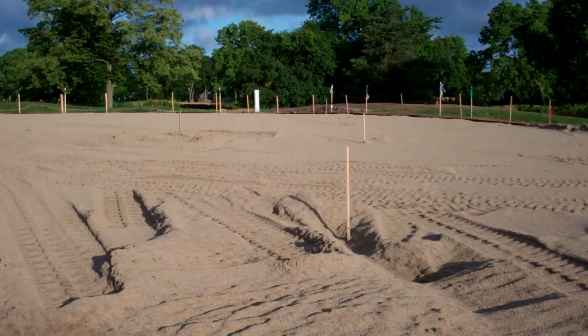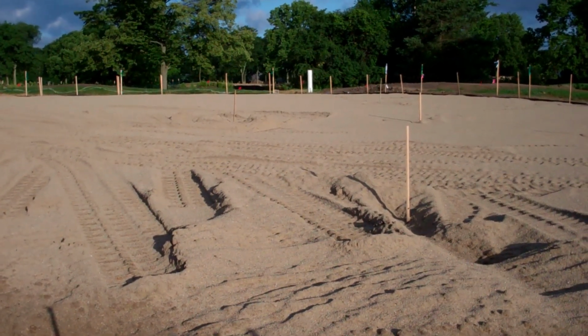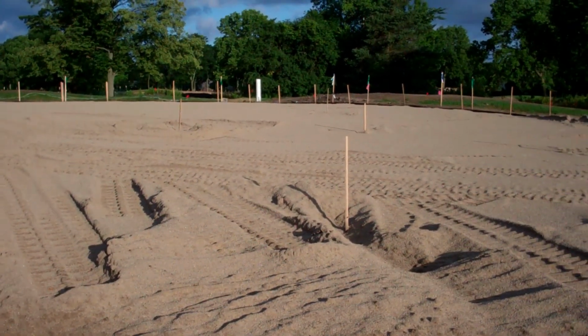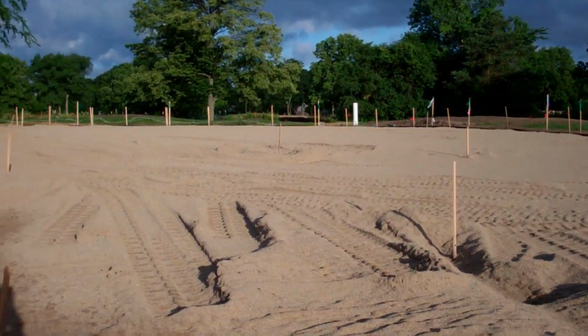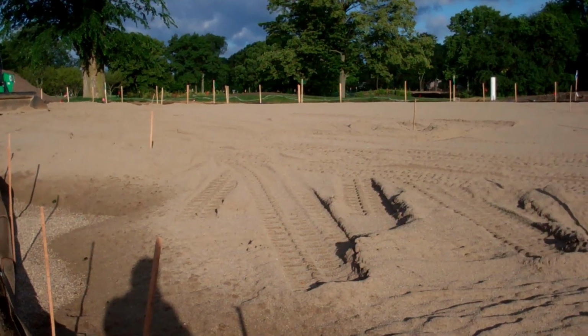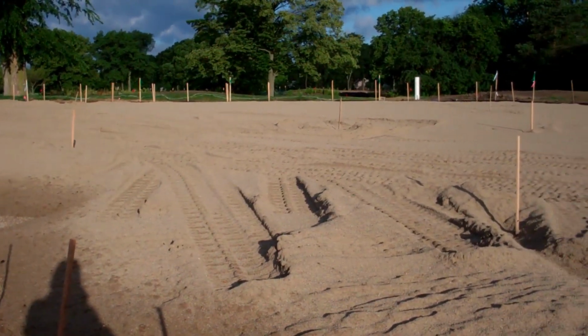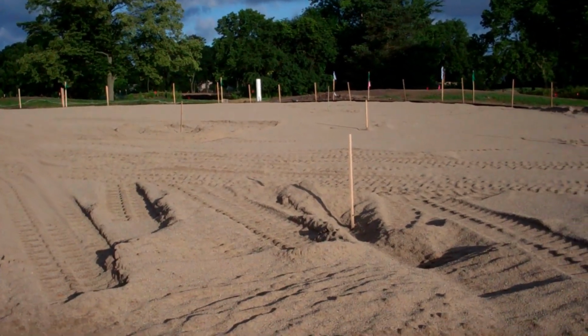In low areas that tend to be wet, in valleys, it's the opposite. It's overdug slightly, so there might be up to 14 inches of mix. We try to balance that out throughout the whole profile. We do that by first digging the cavity with a backhoe, mini backhoe, at the traditional depth to accept the 4-inch pea gravel and the 12-inch mix.